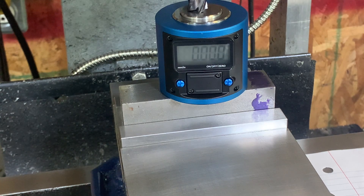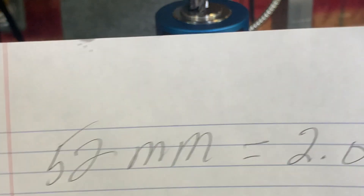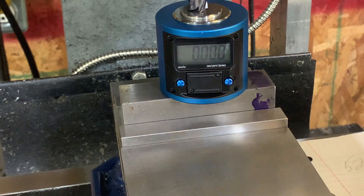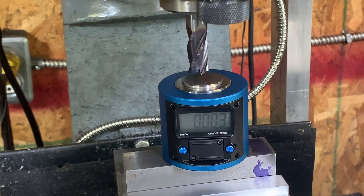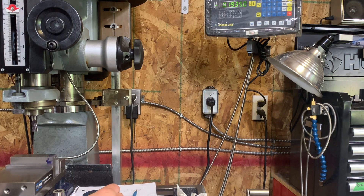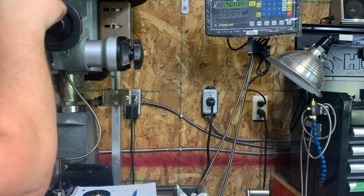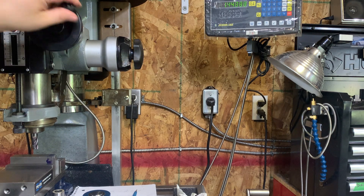So we're set at zero. The DRO is at zero and we know that we took three thousandths of an inch down. The equivalent of 52 millimeters is two inches and forty-seven thousandths. Subtract three thousandths from that and you're left with two inches and forty-four thousandths. So quite simply at this point, let me raise this slightly, redraw this thing, and remove the device. That's our measurement — we know that past zero we need to go to two inches and forty-four thousandths. Down we go — we should be able to reach there and be on the money.